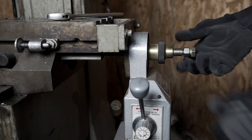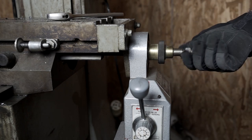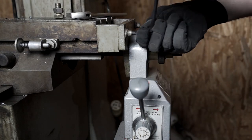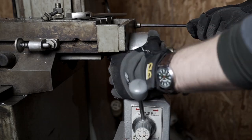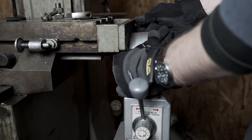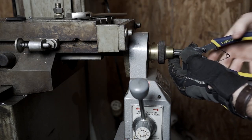The last major piece to disassemble on the mill is the table itself. I don't strictly need to take it off, but I wanted to make it easier to clean. To get the table off you need to take off the power feed first, then the handle on the x-axis, and finally the lead screw to get everything off.